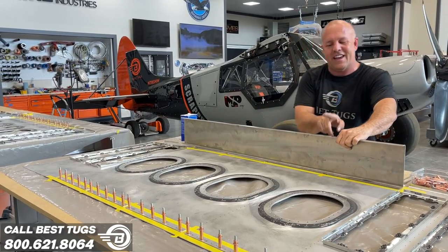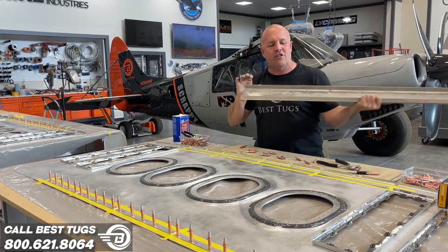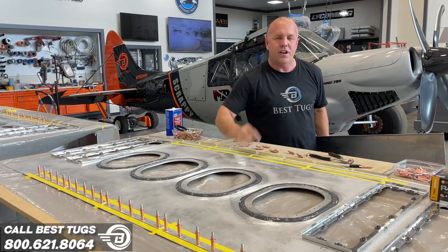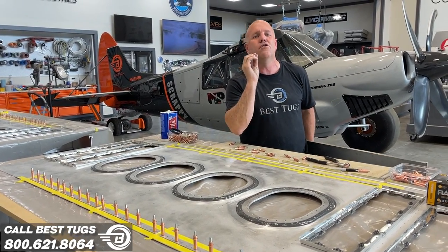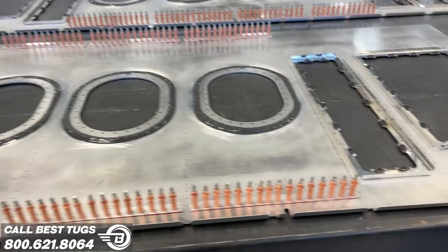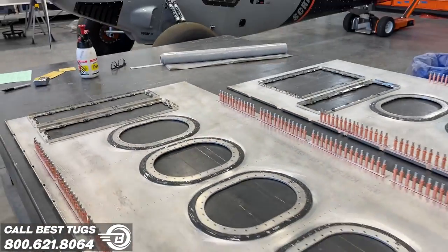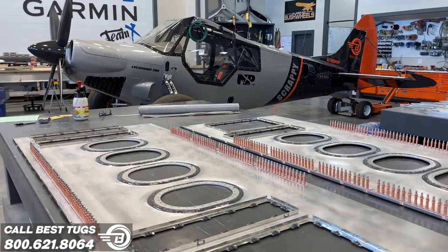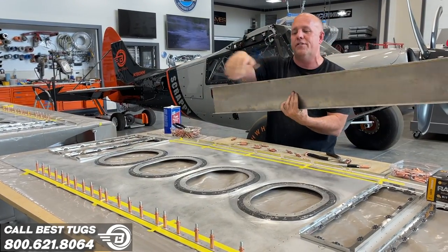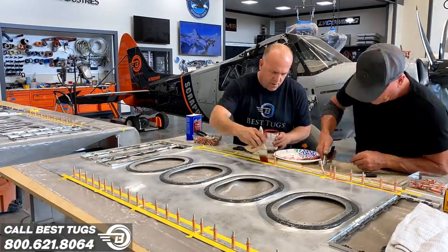A gap under here, a gap on the top. This will get closed off, a wrap to the back. And it just makes sure that when I go to dip to rivet the bottom skin and the top skin, I put in the tolerances of the thickness of the aluminum. A lot of times you see aluminum, they'll just go ahead and let it dip the thickness of sheet metal and make a little curve. It works fine, but I thought it was just a little more work to go ahead, make custom spacers, put them in between, and use a one piece end at the front and back of the tank. This is the small one. There's actually a bigger one, so two different sizes. I don't know, I hope that makes sense. It will when it all goes together.